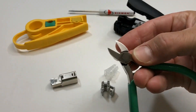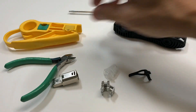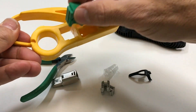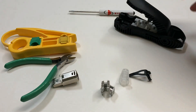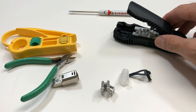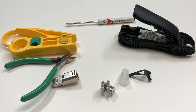Required tools include flush cutters and any cable jacket strip tools such as our CPT-RGTP tool. The optional green stripping die is recommended for extra-large cable jackets such as with our shielded outside plant cable. The Z-Plug termination tool is also required and is included with every standard pack or bulk pack of Z-Plugs. Finally, a small flat head screwdriver may also be helpful if any re-terminations are necessary.